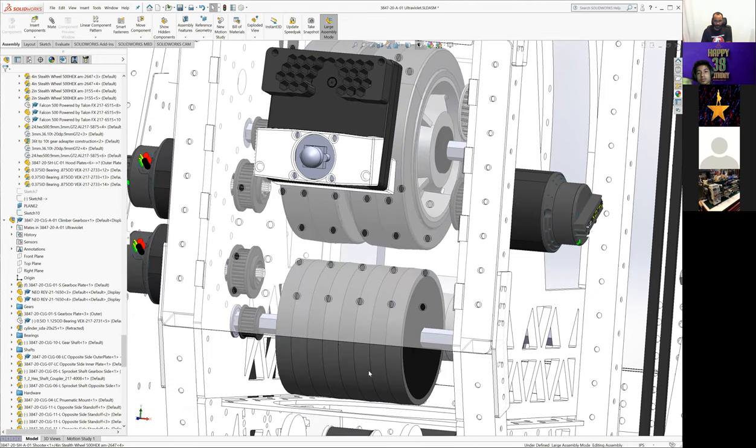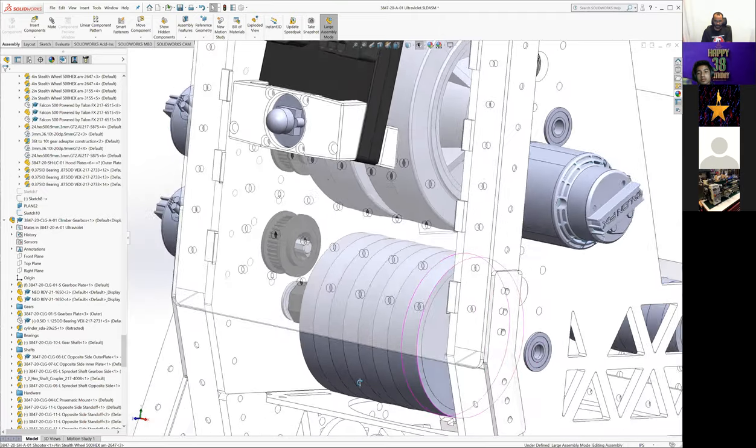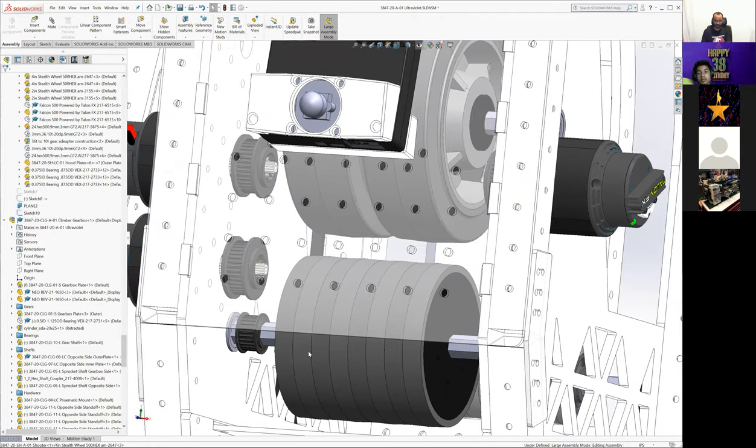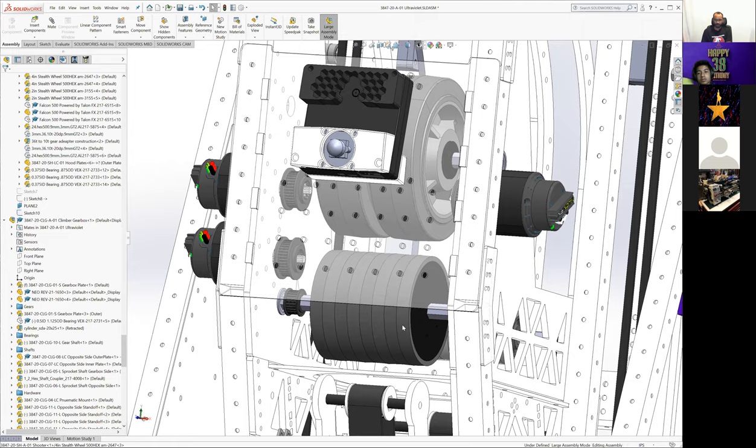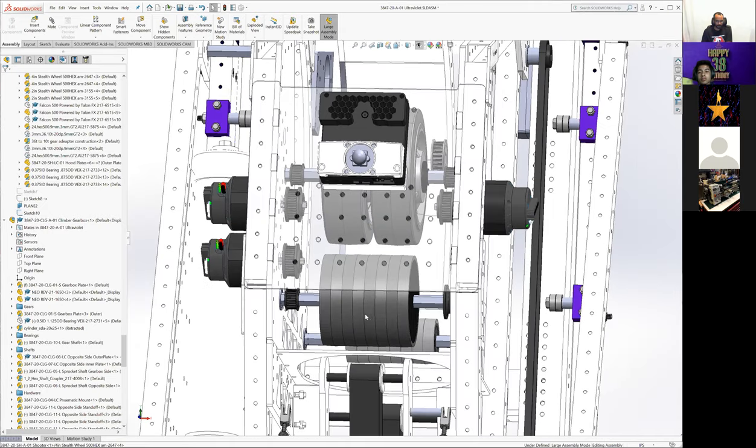These bottom 4-inch wheels are AndyMark Stealth wheels. They're relatively flat and they grip the ball well. We didn't have any issues with them, and they're very light, which here we weren't as worried about, getting a lot of mass on our accelerator wheels as we were about getting the final velocity with the shooter wheels. Whether that's the right answer or not, I don't know. There may be some case for having a little bit more mass here, but they worked well enough.